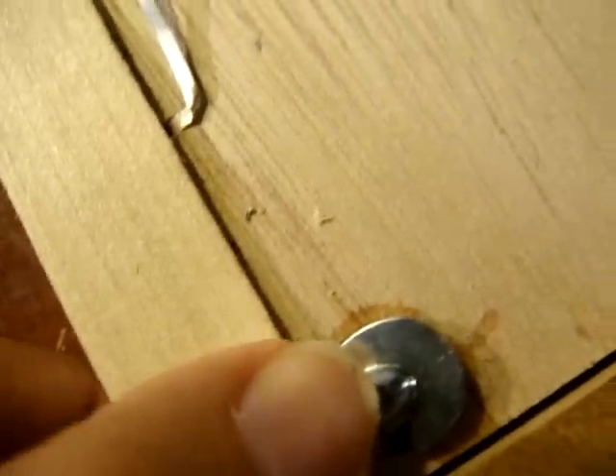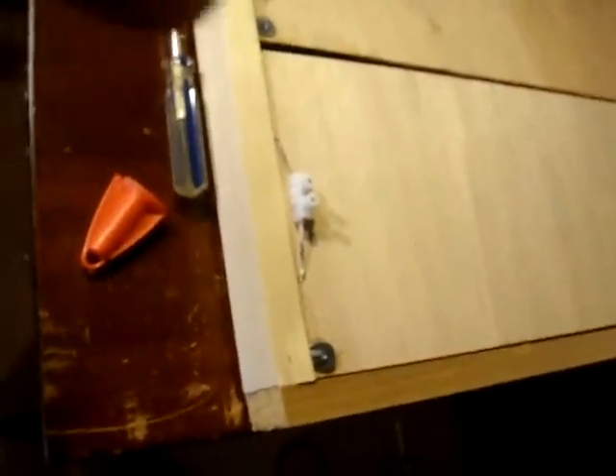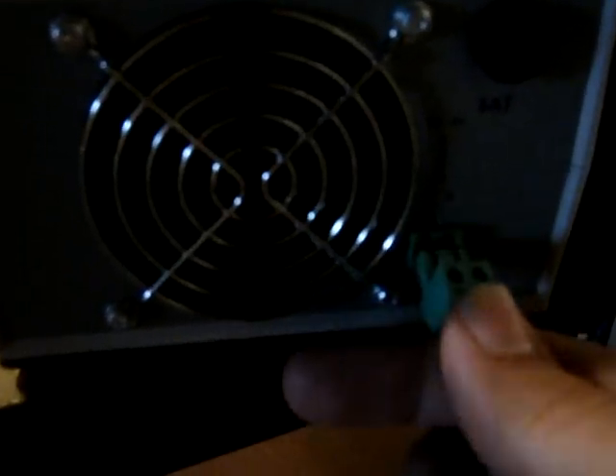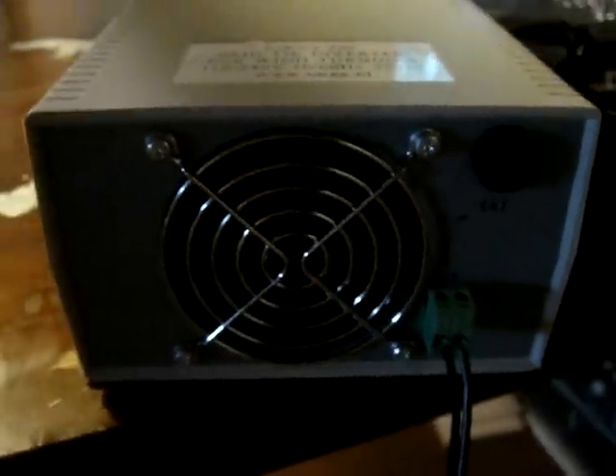I just put some crazy glue on these shelving tabs and I'm going to weight those down till they dry and hold the slat of the shutter. This is the complete solar shutter. I've wired negative to positive across all the slats, and the power comes off the first and last slat to a connector which will attach to the SWE grid tie plug and play inverter, and then we should be able to export power.